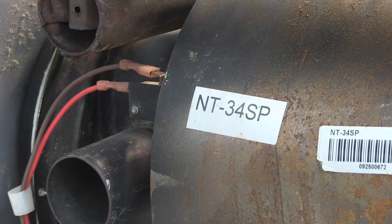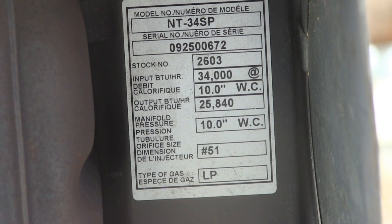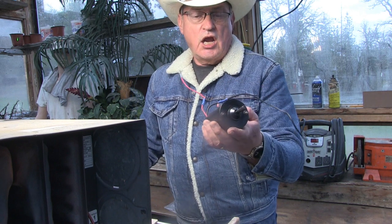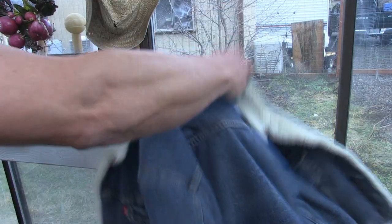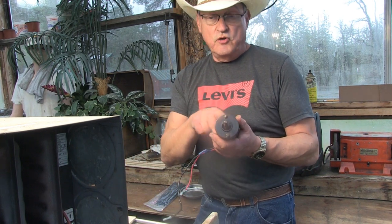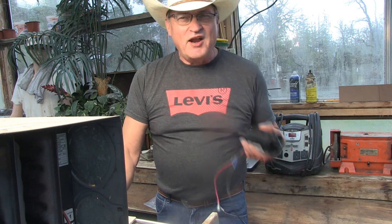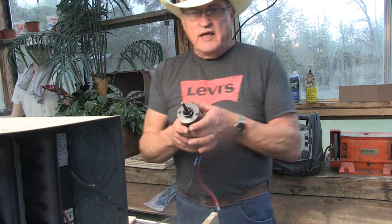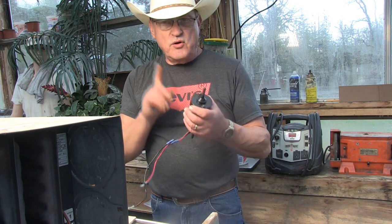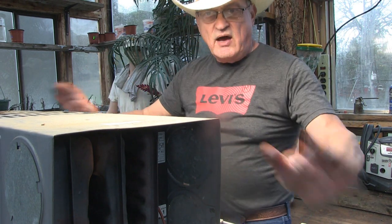We got it in the greenhouse. Let me show you the model number of this thing — here is the actual plate so you can see what it is. When you're ordering parts for this, that's the model number you want to use. I've got my spare motor here. I always keep a spare motor on hand. I initially went and ordered a new motor and replaced it, but instead of ordering new motors every time these things wear out — because they do wear out — I'm building them myself. I'll show you in another episode how to rebuild this motor. If you're looking for a new motor, I'll leave a link down below.